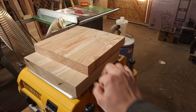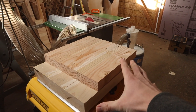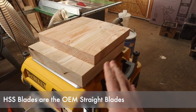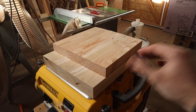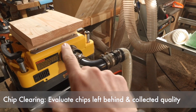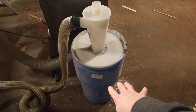It's about 11 and three-quarters inches, just a hair underneath the full width. I want to test what the tear out looks like and also what the surface finish looks like, because my high-speed steel blades are already dented even though I just replaced them recently. To look at chip clearing I swapped out my normal four-inch dust collector and hooked it back up to my cyclone so we can check everything that comes through.